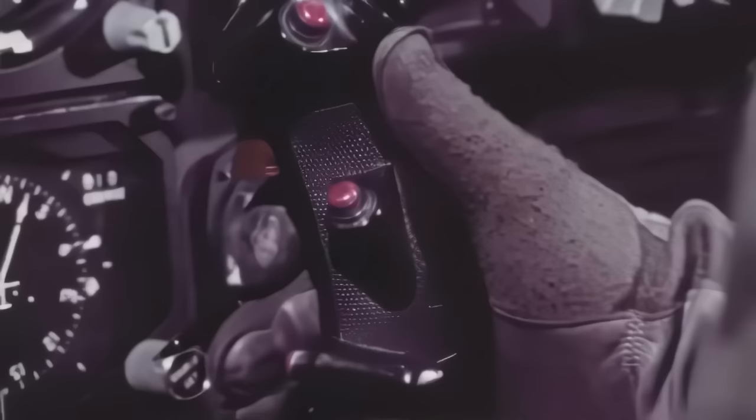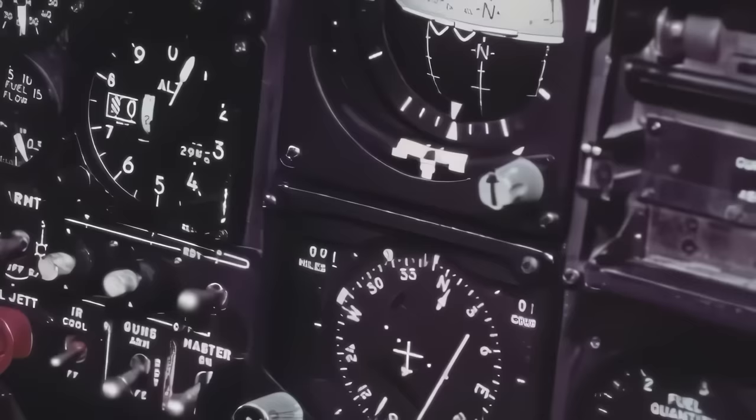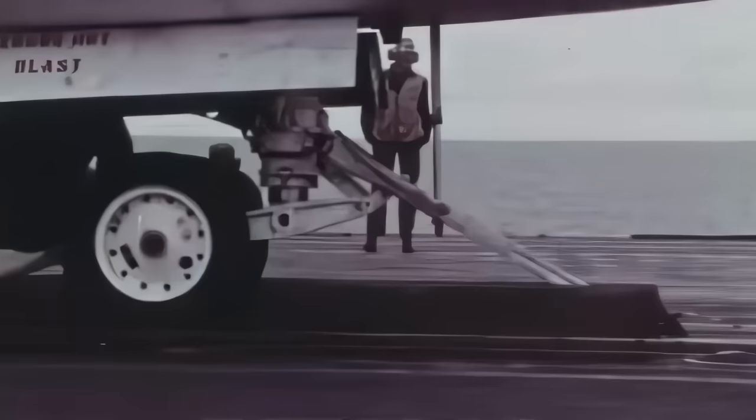Disengage the nose steering on the director's signal. Do not use it after the launch bar is positioned in the track. When you're lined up with the cat, align the compass with the base recovery course. At light fuel weights, a one-finger turn-up may be required to depress the nose strut and allow the launch bar to drop into the shuttle.